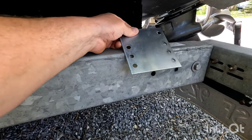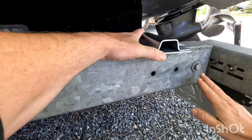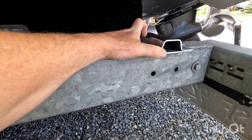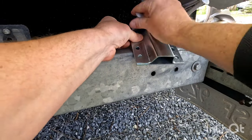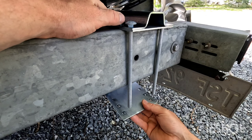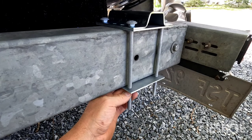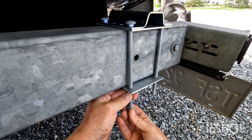To install the bracket, you're going to take this one and determine how far forward or back you want your post — I'm going to go about here. You have your top bracket, and the post is actually going to squeeze in between here. You have this piece of metal, and you can put your bolts through. Then take your bottom bracket and slide it up into the bolts. Put on your nuts — just a couple of threads — because you're going to want to put your posts through before you tighten these up.